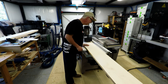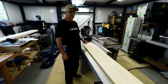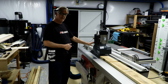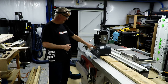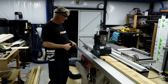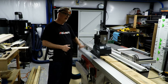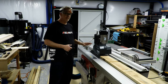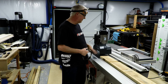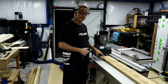It fed through just fine. So I got all this set up. The next thing to do is to run our first cut through. I changed the gear in this to where position 1 is 27 feet per minute and position 2 is 54 feet per minute. I'm going to try running it at 27 first, see how fast it goes, and then do the next one at high speed and see the difference — the saw can handle it with the rip blade. This one I need a 3-inch piece for an end cabinet, and then I'm going to take a 2-inch out of here.